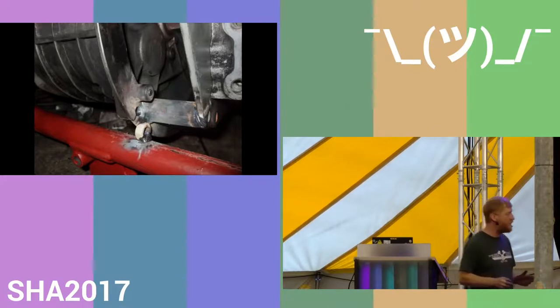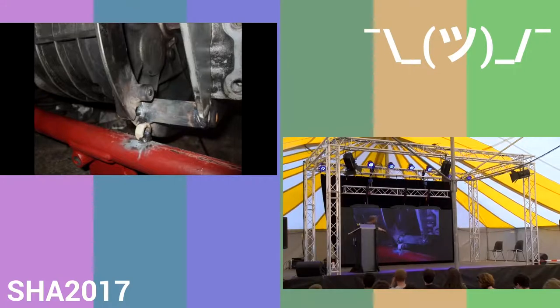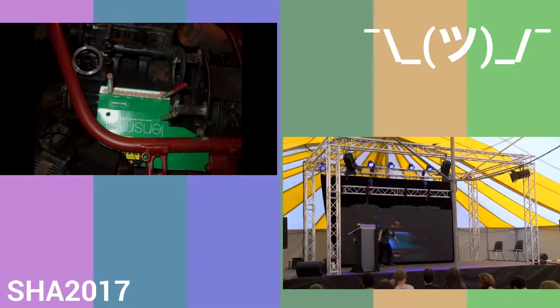The next part was mounting it. So once I very carefully placed it in, using chocks of wood to hold it in place, I then temporarily put a spot weld at the bottom of the chassis to one of the mounting plates on both sides, and then at the top of the engine. And what that did is it held the engine in place temporarily whilst I made templates out of card that went between the mounting plate of the engine and the original holes where the original engine was mounted.